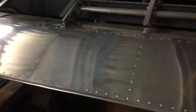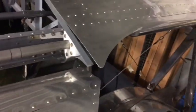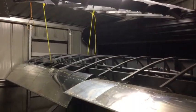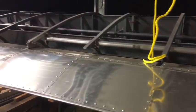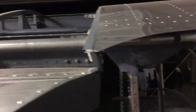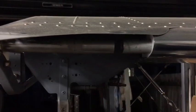And remember when I was hoping last video about this curve that I made in the flap, hoping that it would match the center section. Well, good guesswork. We can work with that. So I've got one wing attached and set up for 1 degree dihedral at the moment. Seems to work nice at that angle. I didn't want to make it flat. I wanted a little bit of dihedral. It just makes it look a bit better. I couldn't make it too high though, because this torque tube here has already got alignment problems. I buggered up and got this out of whack a little bit. Slight miscalculation, but as it is there, I reckon I can recover from that.